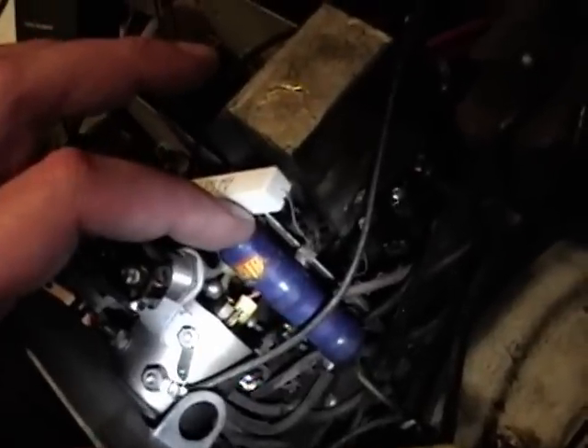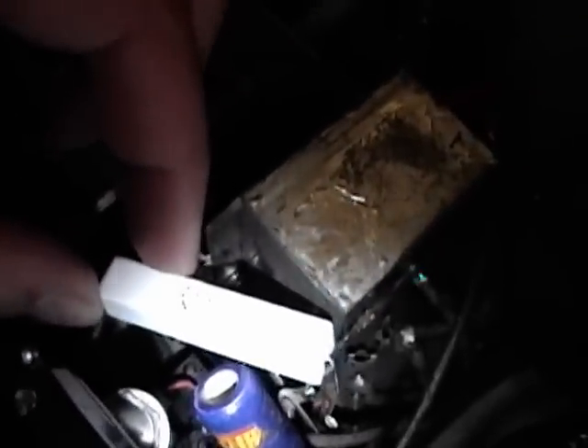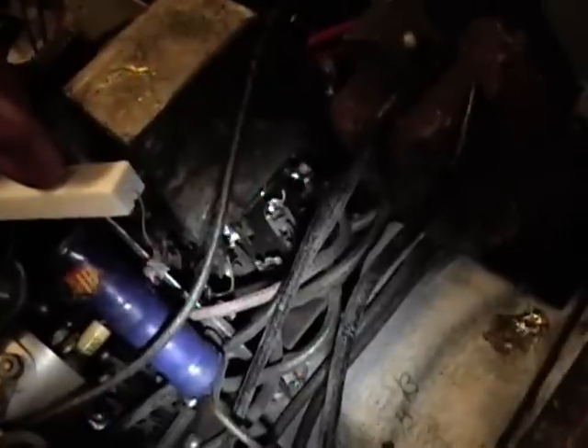There's one disappointment while I was working on this: there's a specialized power resistor with a tap on it. This was fine when I last powered the radio up, but when I tested it again one side measured completely open. So I had to tack in a 1.8K resistor — I'm not sure about the wattage, I just happen to have a 10-watt on hand. I'm hoping that's enough and I'll have to monitor it when I power this up to see how hot it's actually getting.